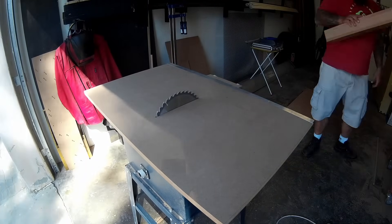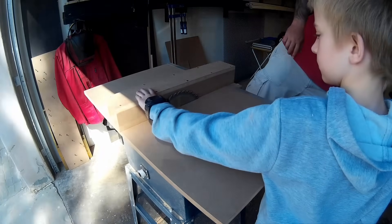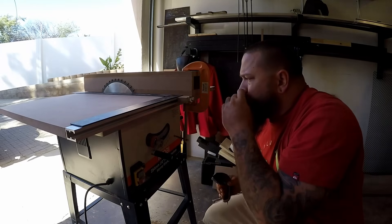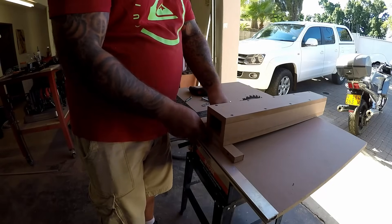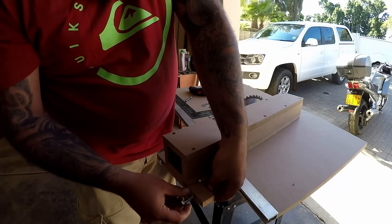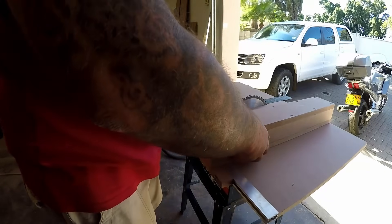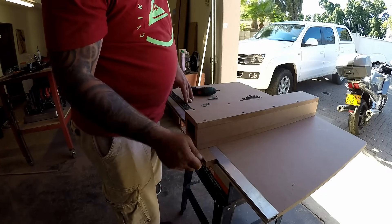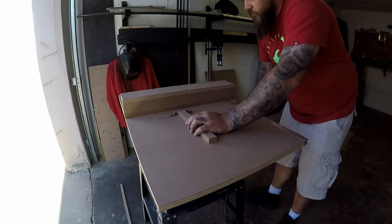Here I'm just dry fitting everything to see if the parts fit together as I envisioned. Checking for square with the blade and square to the table. Once I got everything lined up I drove some screws into the fence to fix those two together. Then I installed the hardware to see if everything works mechanically as planned. I have the wing nuts riding inside the track — initially I had it the other way around, but having the bolt head in the track caused jamming when using two of them. Flipping them around with the wing nut inside the track worked out a lot better.